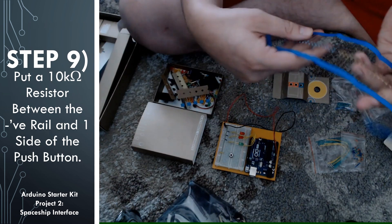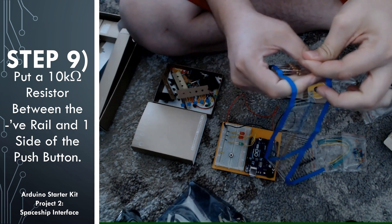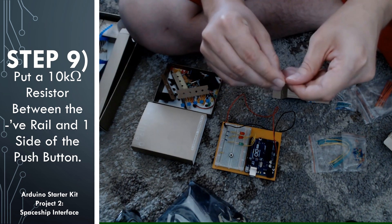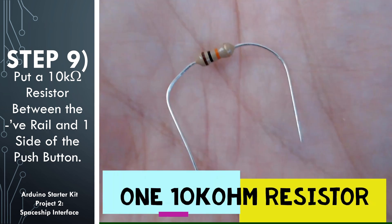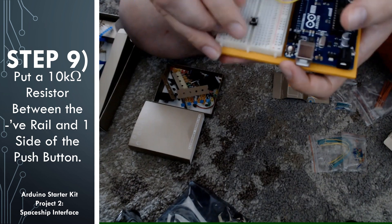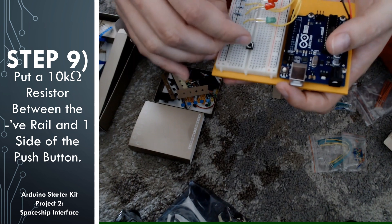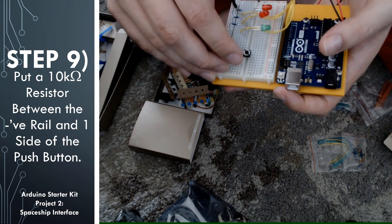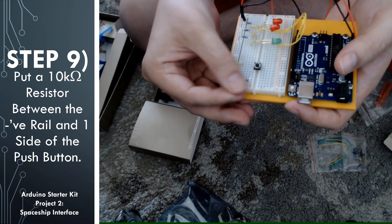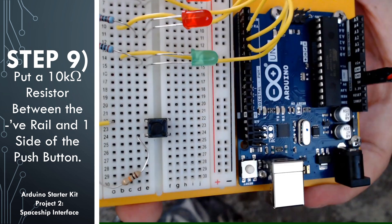On the side of the switch that connects to the Arduino, we're also going to need to add a 10 kilo ohm resistor. We're going to place one side of this resistor on the negative rail and the other side in the same row as the digital pin. This is what's known as a pull-down resistor. It's basically providing a connection between ground and this pin so that when we're not pushing on the button, the pin is actually at ground — it doesn't have any voltage. So when we read this digital pin in the Arduino, we get a nice clean low signal, and when it's pushed, we see the voltage.